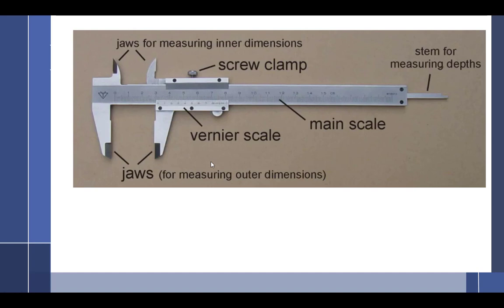Nice try. There is a thing called a vernier caliper. That is what this is, a vernier caliper. Vernier calipers are not appropriate for measuring crankshafts. They're a great machinist tool. I use them more for quick reference. There's vernier calipers, dial calipers, and vernier dial calipers. I prefer the dial type.